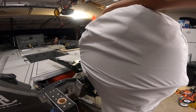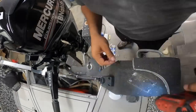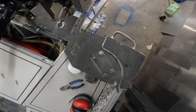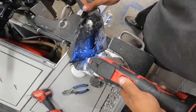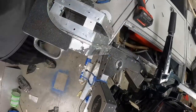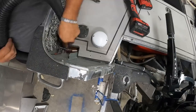This boat has been remodified twice. The first time I cut it from a 20-inch transom to a 16-inch transom to accommodate the short shaft Merc that I bought — it was a stupid thing to do. If you have a 20-inch transom, buy a long shaft motor; don't go down. We're going to try and fix that with this new transom. I asked for a specifically high transom to reintroduce a 20-inch transom, and I'm taking all the short accommodations off and we're going to get to ripping out the transom.